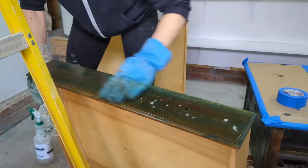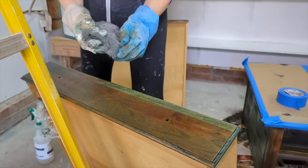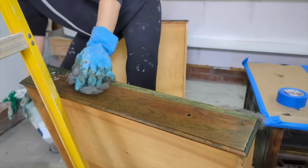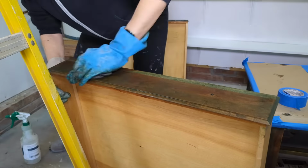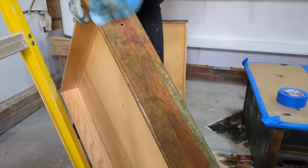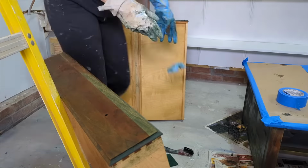Especially for hard to remove paint or stain, this stuff is a miracle worker. My steel wool starts cutting through and you can see that wood grain immediately. And then I go over and I usually spray it again, and I'll go over it with a rag just to wipe the excess off. I bought this product based on another furniture artist's recommendations, and I'm absolutely in love with it. And I was just looking at GreenEZ's website, and they have soy-based stains now and water-based stains that are also eco-friendly. So I'm going to be trying those next.